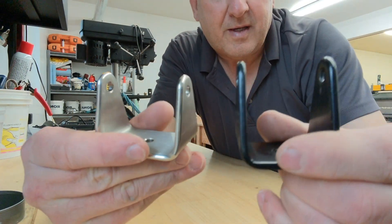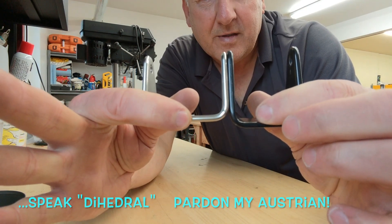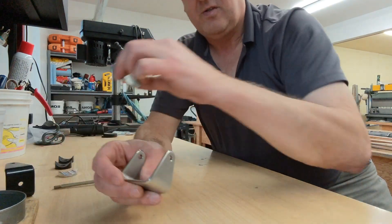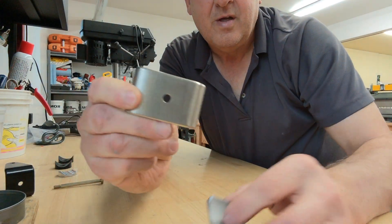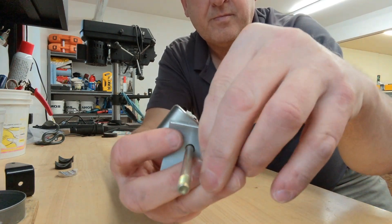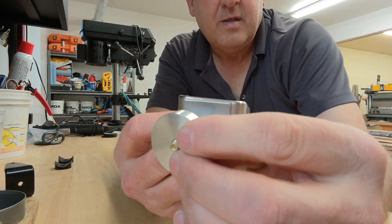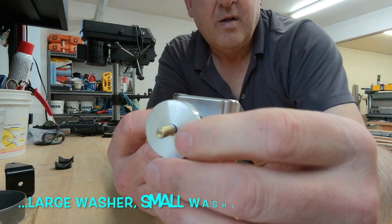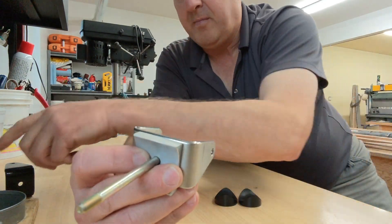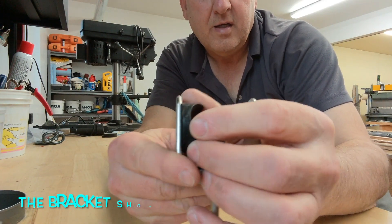In comparison to the new ones — one thing you don't have to worry about is the washout changing on the wing; they already left room for this. Very heavy — very, very heavy — compared to the old bracket. The bracket goes on, the shim goes on top, the bolt goes through, then through the longeron, the rear half-moon goes on, followed by a large washer and the AN4 nut.